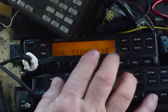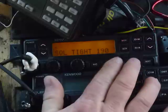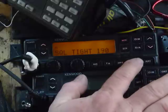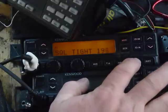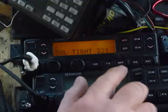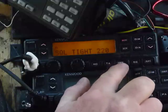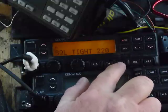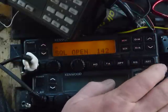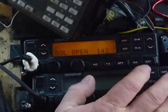Remember, PF3 and PF4 go up and down to change the values. I'm going to hit PF4 until I get up to 221, then go back down one to 220 with PF3. Now I'm going to write the data. Boom — I wrote it. That value's been changed.